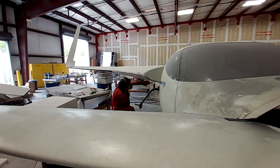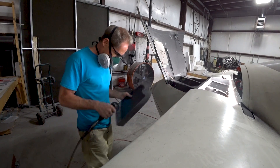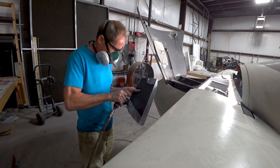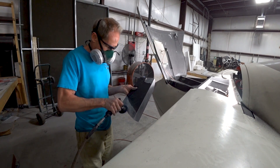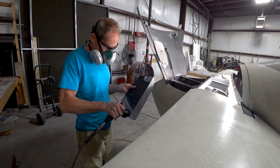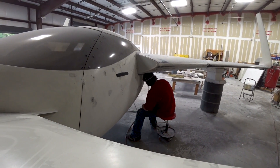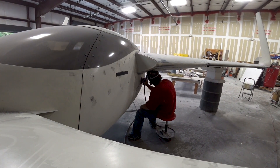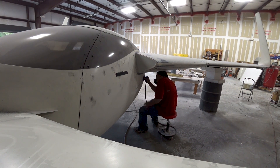I'm working on those L-channel blocks — just a piece like an L-channel that's going to really beef up the cross section of the nose and give us somewhere to bolt up that forward spar in the foreplane, giving it an anchor point. Otherwise it's kind of floating and really needs to be anchored. Jeff's on the other side now working on the seam between the upper and lower parts of the fuselage — he filled that a while ago, just smoothing that out.